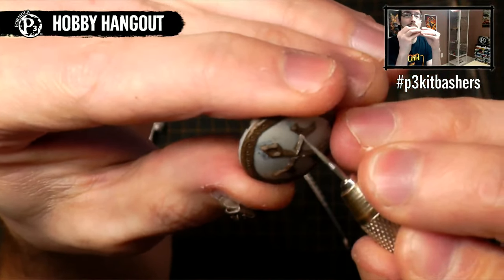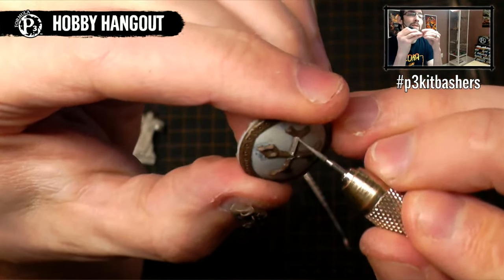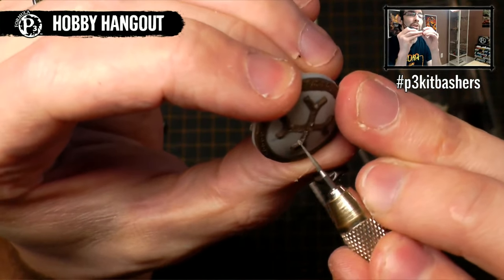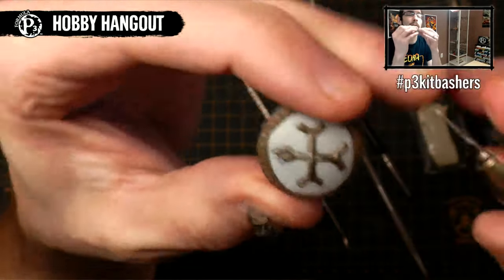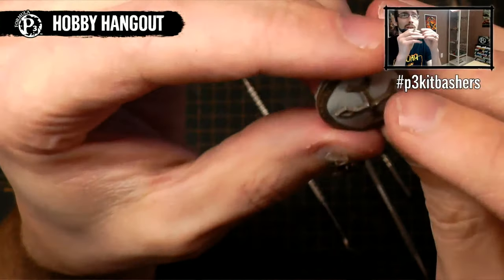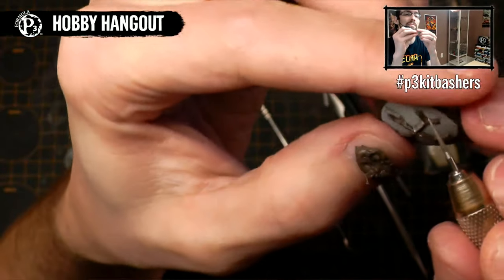And so now you're actually sanding. Yep. Taking my little rat tail file and just sanding this material down, getting rid of any of that rough surface, and just refining those sharp tips that I'm really looking for. And if you have any little dips, grooves, rough spots, when you go and put paint on it, it will pick up any of those imperfections.